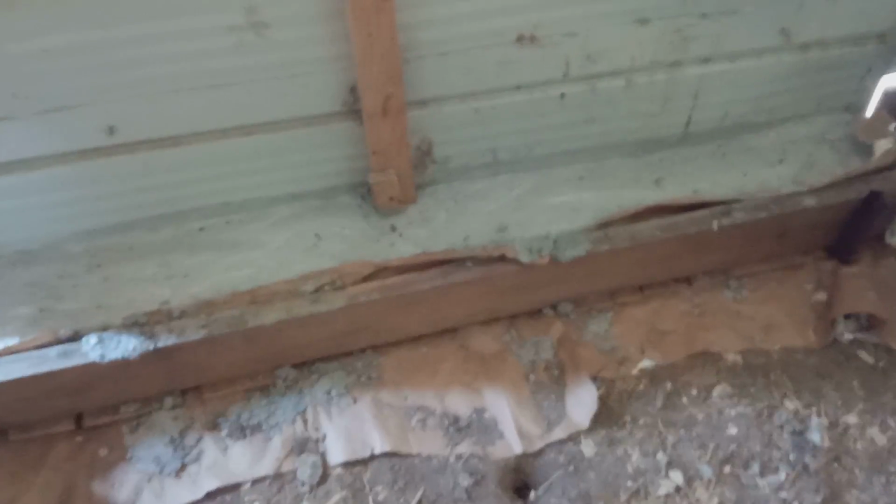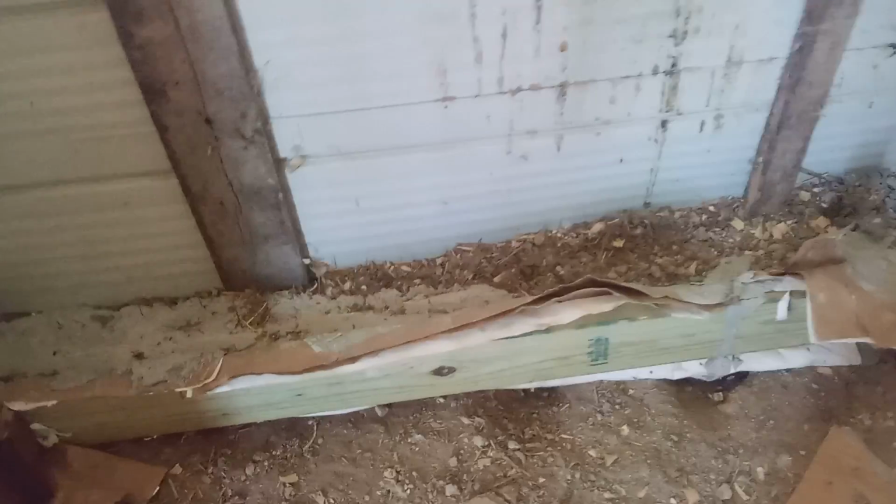I used paper this time instead of grease oil because I didn't want to. That right there is finished. I'm going to be using that in the floor, so I didn't want to put oil on it. So that's just paper sacks, feed sacks, and the theory is once I pull the form apart, that most of that paper will come off.